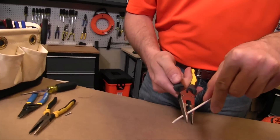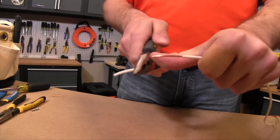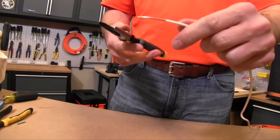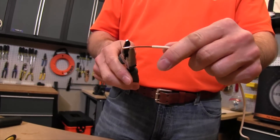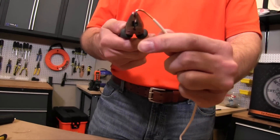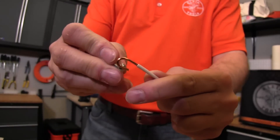Line it up into the 14 solid hole, give it a little twist, pull off — and there you go, just like butter. Another nice thing about this is it has a long tip nose so that when you're looking to make a loop to go around a screw, it easily loops into the size that you want to fit around a screw.